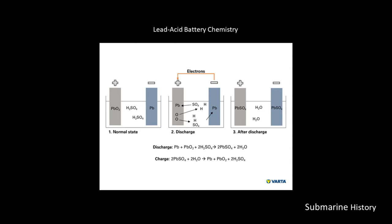To charge the batteries, we go through the opposite process — we impress a current the other way through the battery in order to drive off the sulfates, get everything back into solution, and get the plates back to their original state.